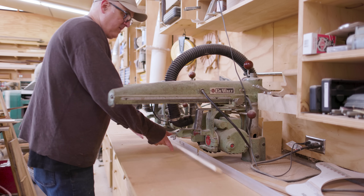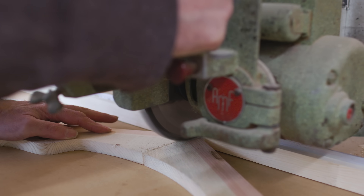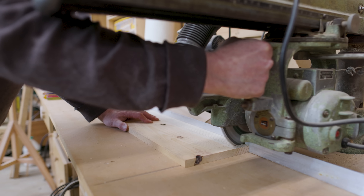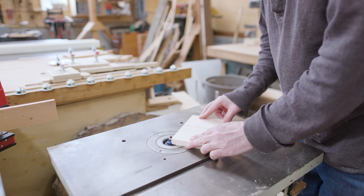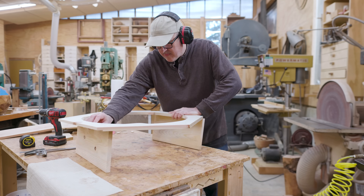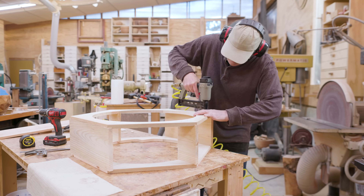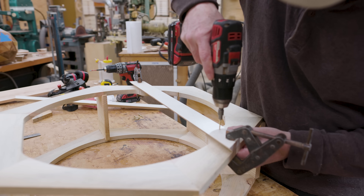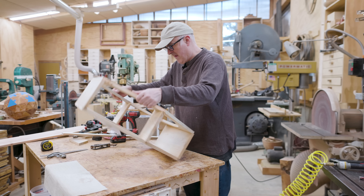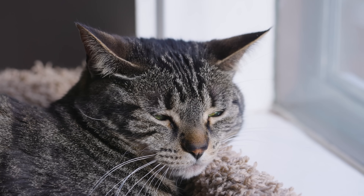At the midpoint of the rings, parallel to the other two dados, I needed a short dado, so I used the radial arm saw for that. I then cut pieces for the floor, the ceiling, and two short pieces for the midpoint platform. Gluing everything together went nicely, and I attached the cleat to the back — you can see how the cleat works with the little bumps I made on the back ring. It's not strictly necessary but gives a good location for the cleat.